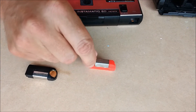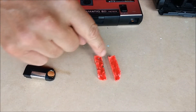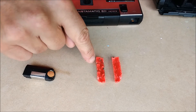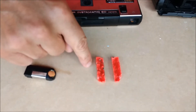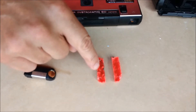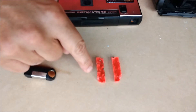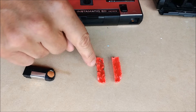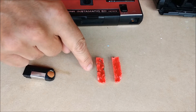As you can see, this is kind of the shell of the battery, and if you're very careful with a razor knife or X-Acto, you can open it up — there is room for three cells inside. You can replace these cells and make it work in the camera no problem. However, it is a bit tedious because you have to connect the three cells together in series, use spacers to prevent shorts, and connect the batteries with wire. Some people have soldered the batteries together, which is never ideal, but you can use a conductive adhesive. I've done it once or twice and found it to be very difficult.